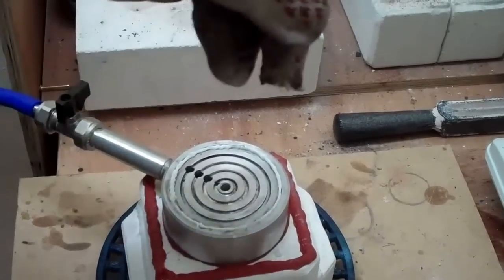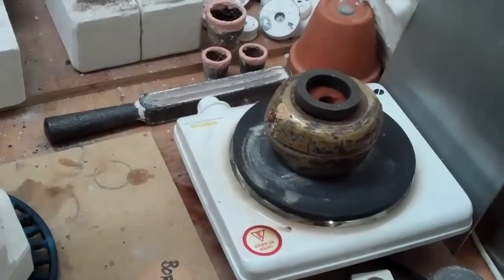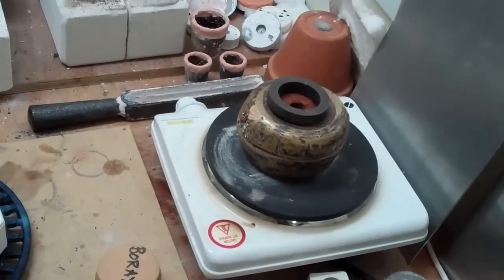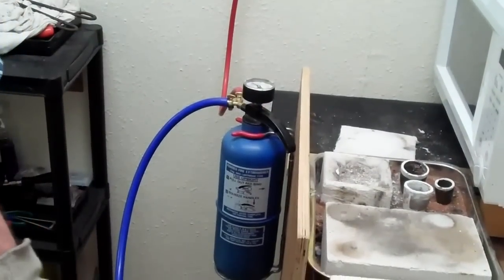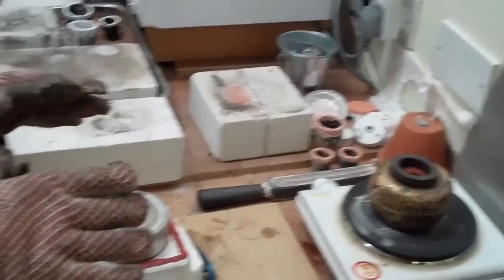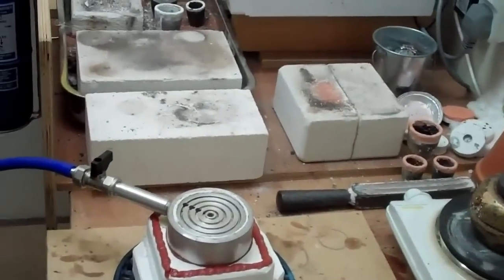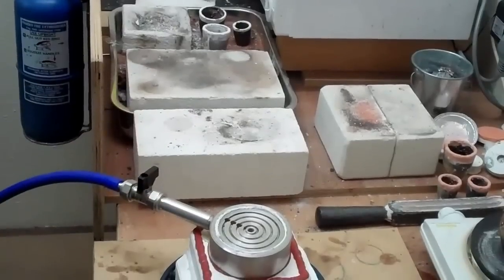I'm warming up the mould; the mould will go on at about 120 degrees. We've got to handle it, so that's quite enough in the sand because the outside brass flask will be getting on for 200. We're pumped up to about half an atmosphere — lower than we do for jewellery work — because the sand is a big area and as you increase the area you rapidly increase the pressure. We don't want any chance of pulling and destroying the sand mould. So about 15 inches of mercury, half of one atmosphere, is what we're going to use to gulp the metal in.